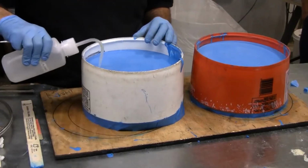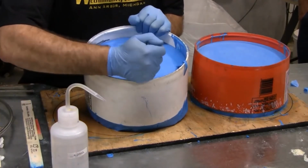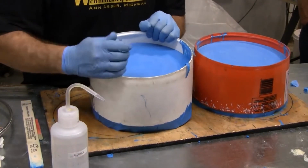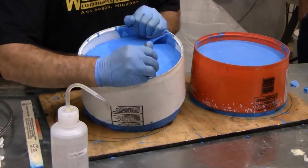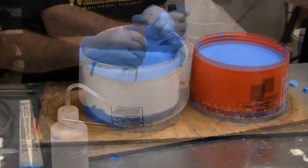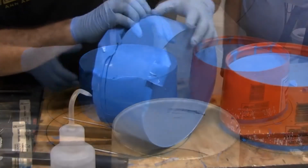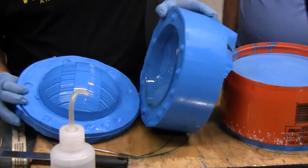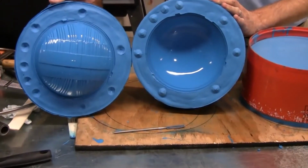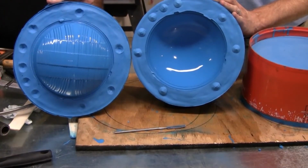After the mold was cured, we applied some talc powder to break the surface tension to make the mold a little bit easier to handle. We then took an instrument to break the seal between the mold box and the mold. Now that our mold is made, go ahead and separate the two halves. It's important not to touch any of the glossy areas of the mold, as this can dull the mold. Carefully remove your original, reassemble the two halves together, making sure that the locators are lined up precisely, and then clamp the mold shut.